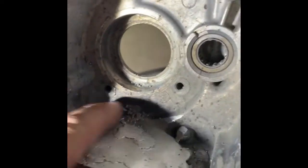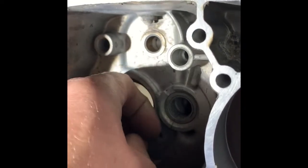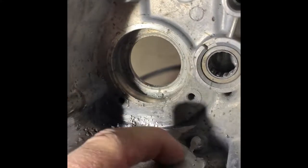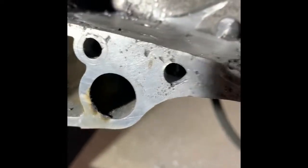I'm going to pack JB Weld in as tight as I possibly can. Another lesson for you guys: protect the surrounding area — get some thin sheet metal and stick it in there to protect the rest of what you've got going on. That was my experience: I messed up big time by trapping all that air in that cavity right under where I was trying to weld. Once you seal it off, that hot air has got to escape somewhere — that's why I was getting so much porosity. Make sure there's a relief hole somewhere if you're going to weld a floor on cast aluminum.